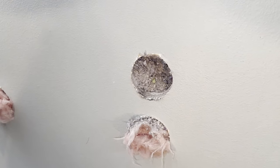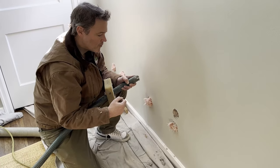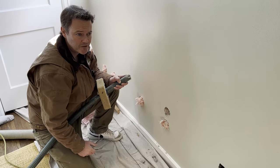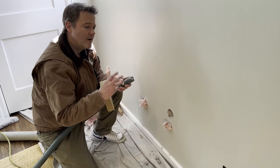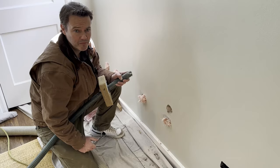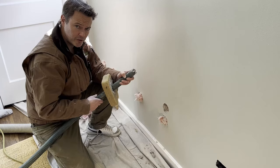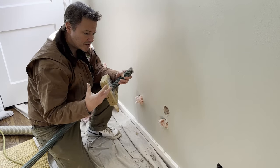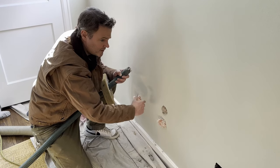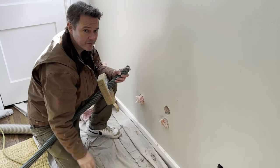You can see how tightly this is packed inside this bay — I can't even push my fingers through that cellulose insulation. What that means is that any wire holes, any penetrations that outside air was moving through to enter the structure, or even bugs and insects, are permanently sealed. People sometimes ask whether cellulose insulation settles. The old-school way of putting it in — it does, and we still have some people in our area that do it that way using a much smaller hole. But when you use a fill tube and a machine like ours that has an airlock mechanism in it, this is the result. This will never settle. You can infrared this 10, 15, 30 years from now, and that insulation is going to be right at the top of that bay.